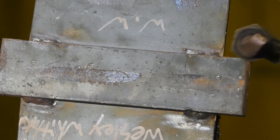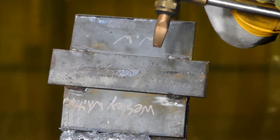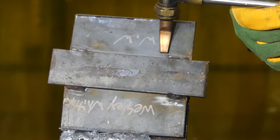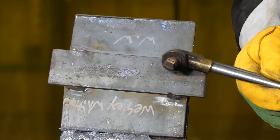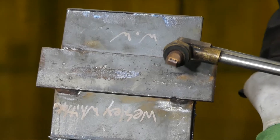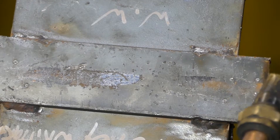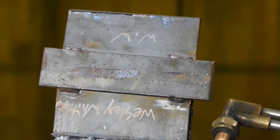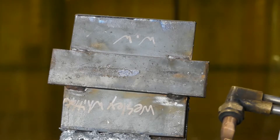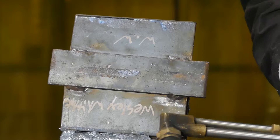I'm going to use a curved tip with a flat bottom on the backside, so we can rest it on the plate and get nice and tight and close for washing. These washing tips have a larger diameter orifice in them, so we're going to have to use a little bit higher oxy-acetylene pressures for the flame to stay on instead of popping out all the time. We're going to use about 8 psi on the acetylene and 50 on the oxygen.